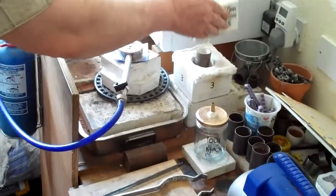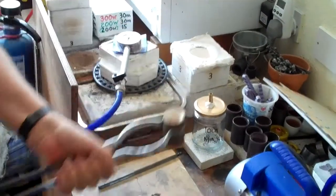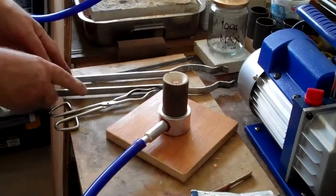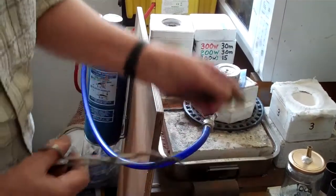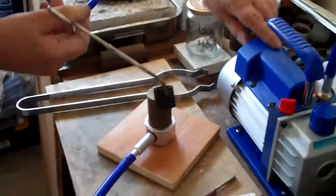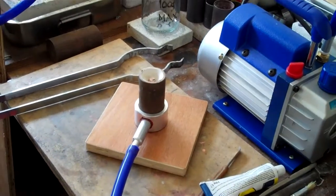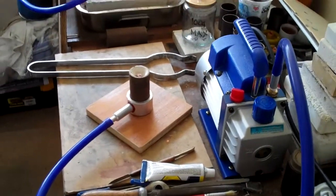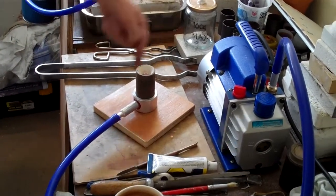Wearing gloves, when the time's right, you introduce your hot mould into the silicone seal. Press it down gently, and again wearing gloves and your borosilicate stirrer, simultaneously turn on the vacuum and pour the melt. Give it five seconds to run — anything that hasn't happened after five seconds isn't going to happen — and your casting is complete. You'll find that 99 out of 100 are a good, fully filled, solid casting, as long as you've got your seal made properly around the bottom.